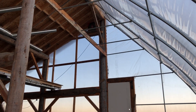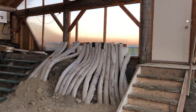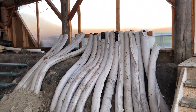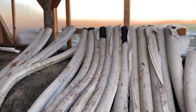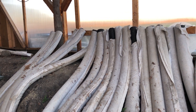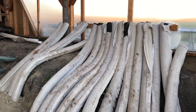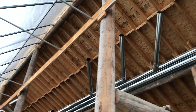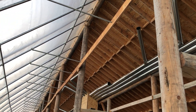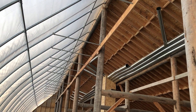I mostly finished off the subterranean heating and cooling system ductwork. There's about 3,500 lineal feet of mostly perforated — about 20% solid — 4-inch diameter HDPE, some in sock. The solid stuff is not in sock tubing. It seems to be working really well at tempering the temperature within the greenhouse when it's exceptionally hot. I managed to scoop up all of this ductwork from a Rona that was turning into a Lowe's for 90% off — 10 cents on the dollar — and it's got this kind of cool steampunk vibe.